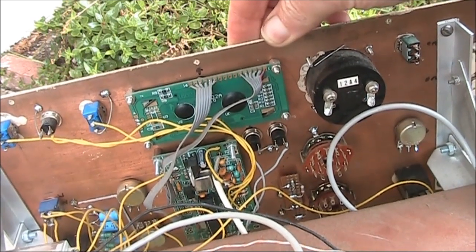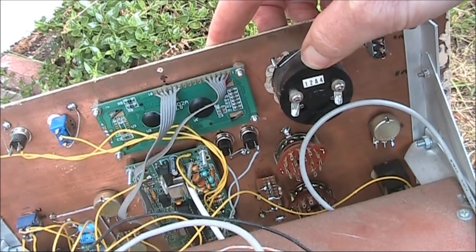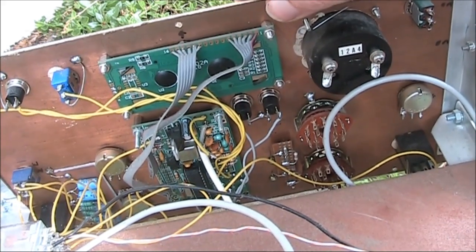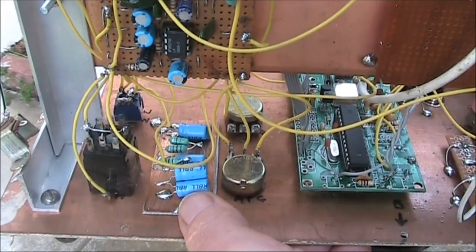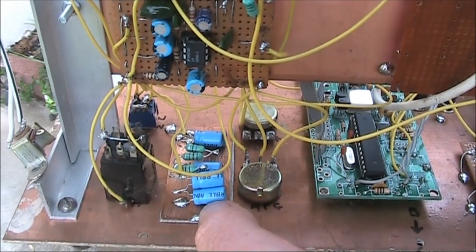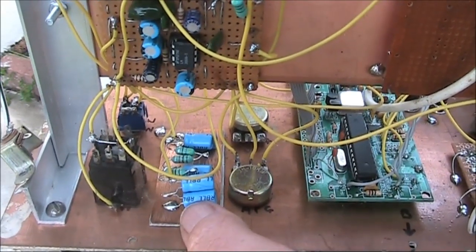The front panel is made of printed circuit board. That's easy to work with — particularly handy when I had to cut the large hole for the panel meter, which I haven't yet connected. Mounted on the back is the N3Zi DDS VFO. This is an audio low pass filter. This isn't going to be a serious CW transceiver — it's mainly going to be for SSB — but the filter will provide some help when receiving CW signals.